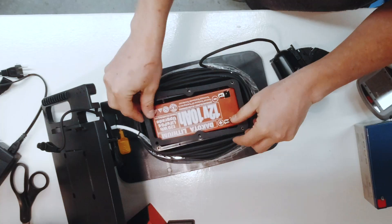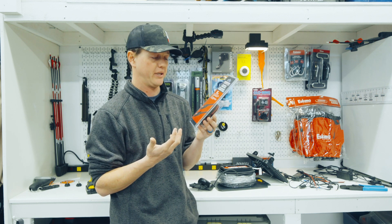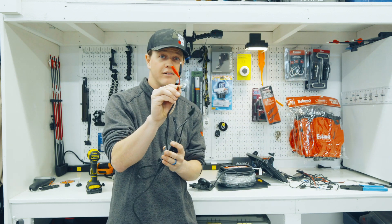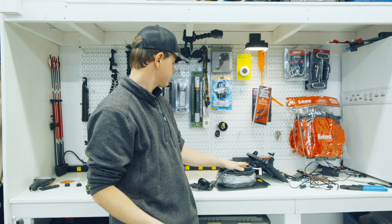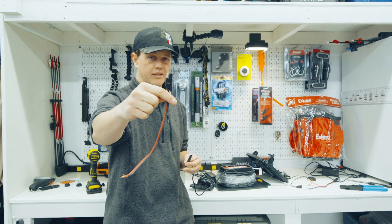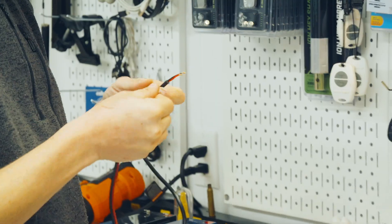Dropping the battery in — fits like a glove. A lot of this I'm figuring out on the go. This is a quick connect extension cable — it's just got two little quick connect ends, and this is going to make it a lot easier rather than opening it up to charge it. I chopped it in half, cut these alligator clips off. I'm going to put one end onto the charger and one end onto the battery terminals. I cut those pigtails off. Make sure that you match them up accordingly. Put a little heat shrink tubing on, and I'm going to crimp them together.